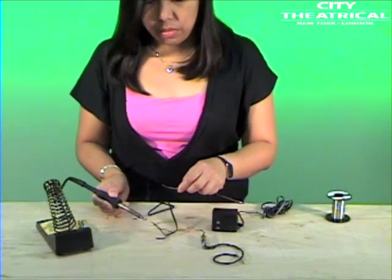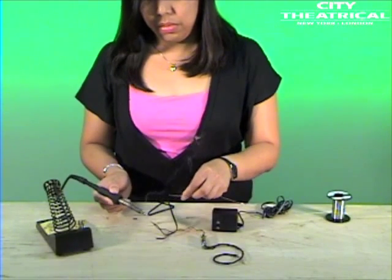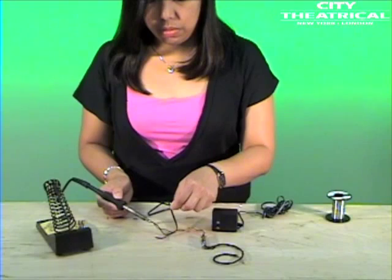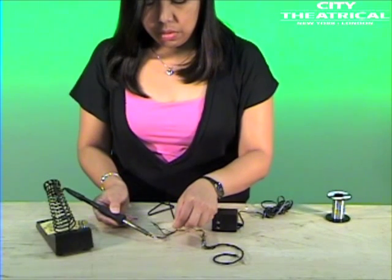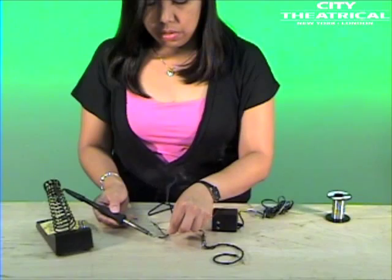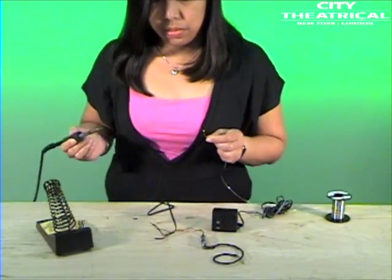To attach the candle kit to an AC adapter, unplug the adapter, cut off the battery snap, and connect to the candle kit leads by soldering, using wire nuts, or by other mechanical means. Attach the red lead to the positive terminal and the black lead to the negative terminal. Take care to maintain polarity.